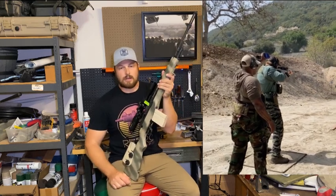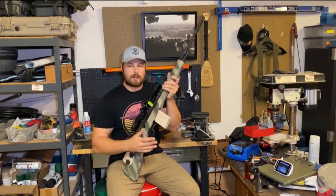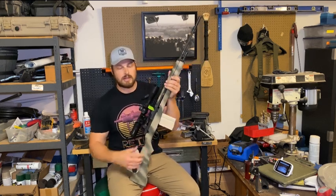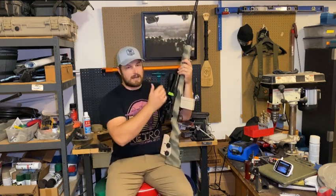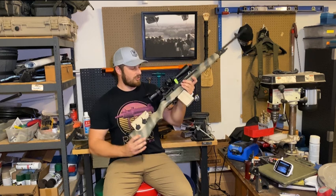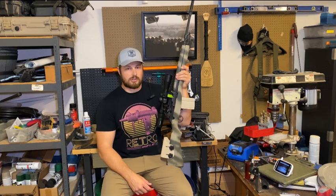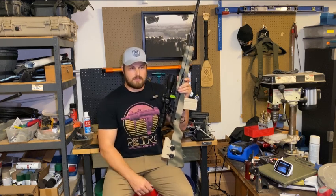It worked out so well I ended up coming out on top of that match. When I was training with the gun beforehand just prepping for the match, you could run the gun so fast. People think the M1A is kind of antiquated, but between accurizing it with bedding the stock, adding shims to the gas system, adding a Matthew Fabrication cheek riser — as soon as you add that offset red dot when you have little glass on the gun, you can run it so fast. It showed in competition and I was really happy with the results.